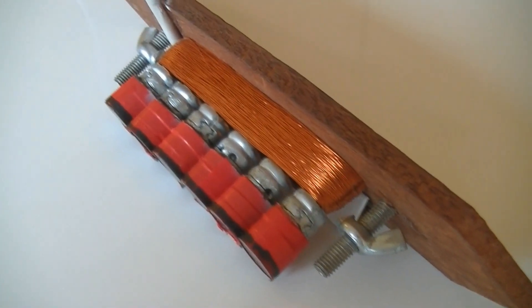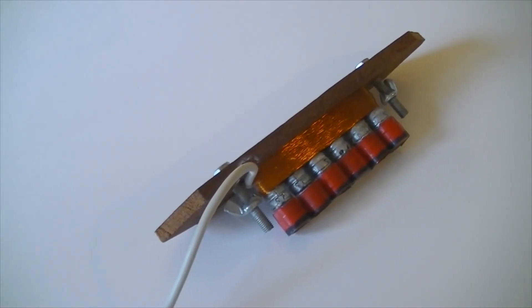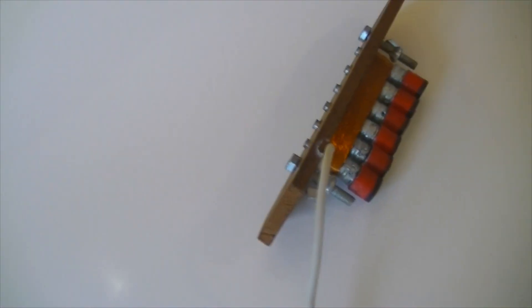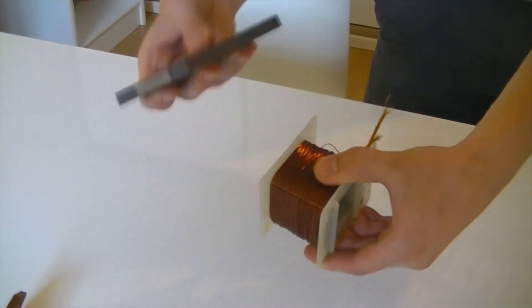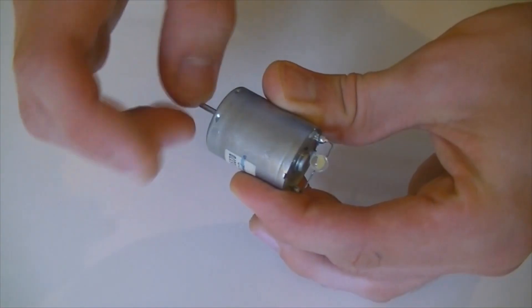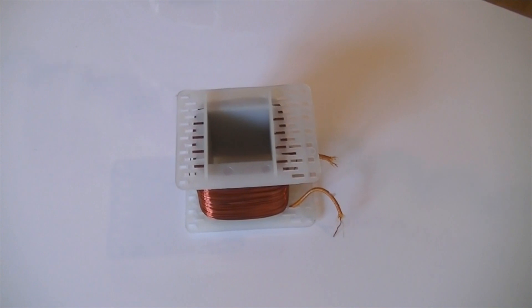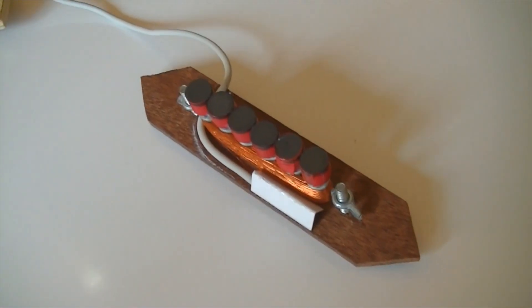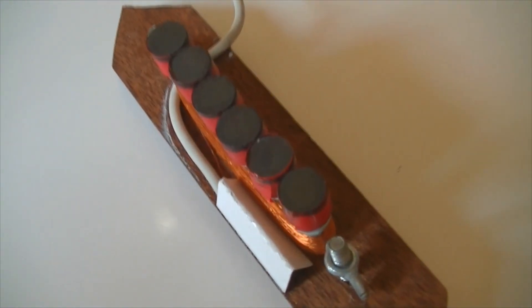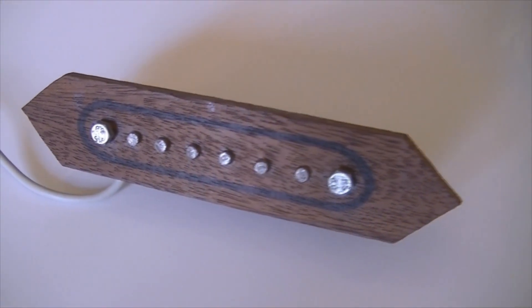In theory, the electromagnetic sensor's functioning is easy, but we did face a lot of problems to make it. The goal is to create an electric current from the string movement. An electric current can be created in a coil of wire from a magnetic field variation. For example, in a generator, an electric current is created if you move coils in front of magnets. But the problem is that strings aren't magnets, so we can't just put a coil in front of them to get the signal. We have to make the strings slightly magnetic by using magnets that aren't attached directly to strings. We'll use remote magnetism by placing them on the sensor.